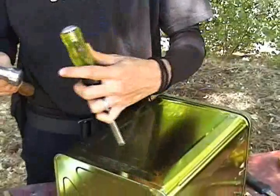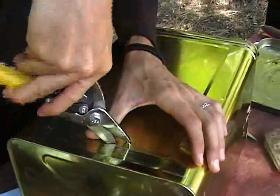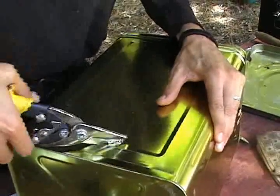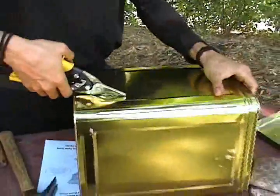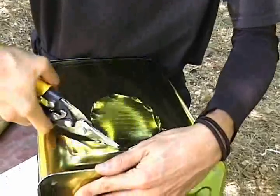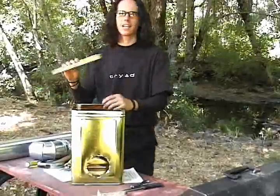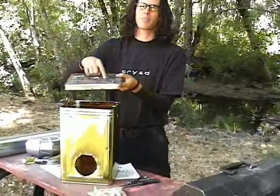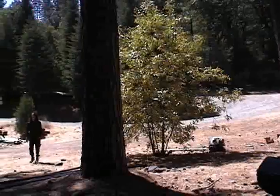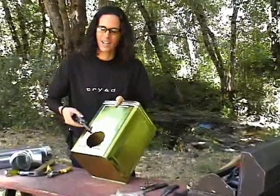You'll need the hammer and chisel to begin the hole. Once the hole is created, take your tin snips, get them in there, and cut around the line you just made. It's good to cut on the inside of the circle a little bit so that it's tight enough to hold the stove pipe. The first hole's been cut. The other important thing is that your can needs to have a lid — the lid is important to hold the top part of the chimney. Take your file and go along the edges of the can, wearing down all the sharp points.